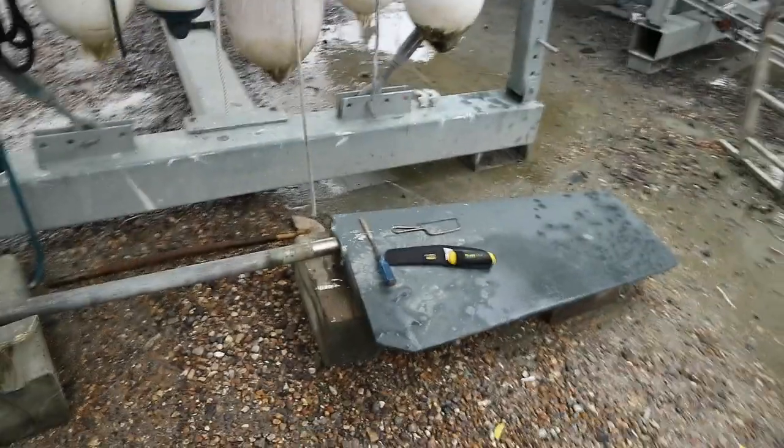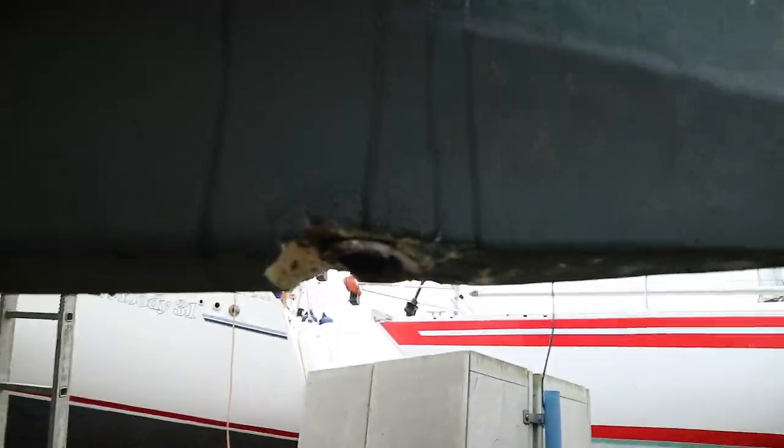Last year we had a lot of play in the rudder, especially going upwind — wobbling around all over the place. Downwind she's quite a nightmare on the helm anyway so you don't notice it, but going upwind there's a lot of slop in the rudder, so we're going to replace the bearings. We've already got the rudder off, which was quite epic — we had to lift the boat a full meter up in the air to drop the rudder out. The rudder's down here on the floor.